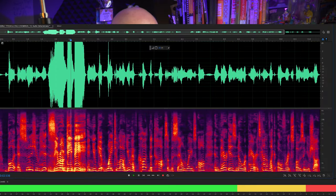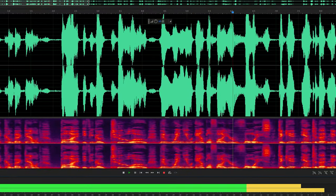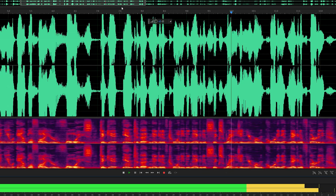All you're trying to do is collect your voice and sound waves as high as possible without hitting 0 dB, and stay away from that negative 30 to negative 40 dB floor noise. Recording in the negative 20 to negative 6 range gives you fluctuation to work with. If you hit 0 dB you've cut the tops of the sound waves off and there is no repair — it's like overexposing your shot. But if you go too low, when you amplify your voice you bring the floor noise up with it, and you get air conditioning, refrigerator, neighbors' dogs, kids running around.